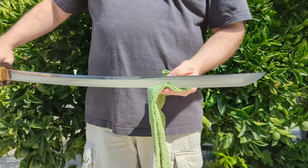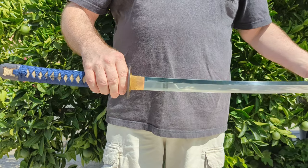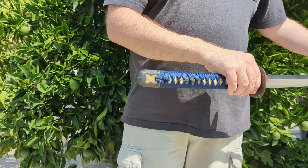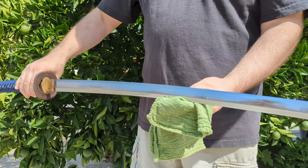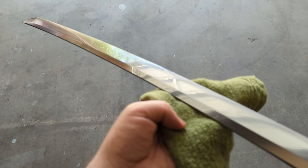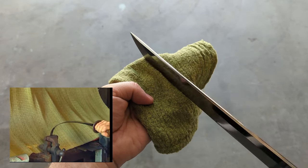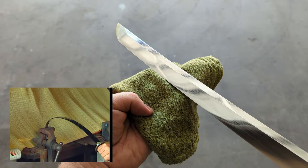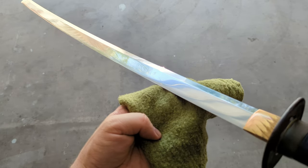In contrast to that, Mr. Clark's very specific and difficult heat treatment process produces a bainite structure. Bainite is both very hard and extremely tough, leading to swords that hold an edge for a long time while also being resistant to chipping. In addition, they're able to flex well when bent. I've included a link in the description to a video of Mr. Clark's destruction tests on one of his L6 bainite katana so you can see just how impressive they are.